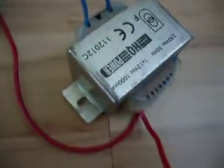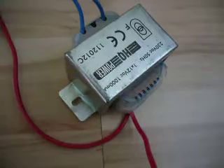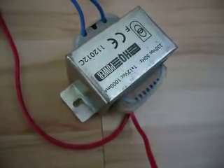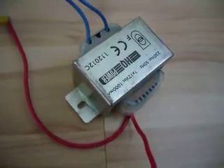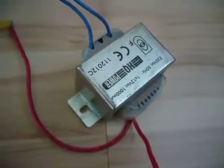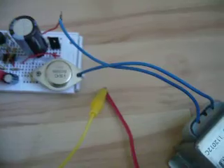At its maximum power, I have to say one thing: these transformers are not supposed to handle a few thousand volts. They will work for some time but most of the time they will fail after a while, so you have to get the right transformer. You may try a microwave transformer - that sounds weird, but you are just pulsing this thing with short pulses, so it's not dangerous. I haven't tried it, but I think it could work.